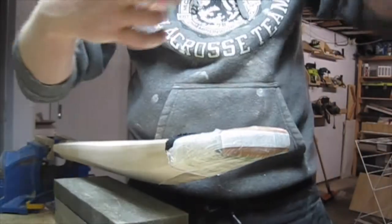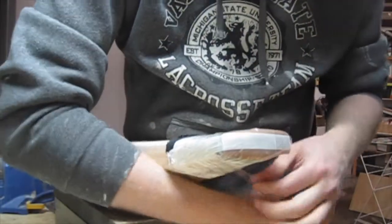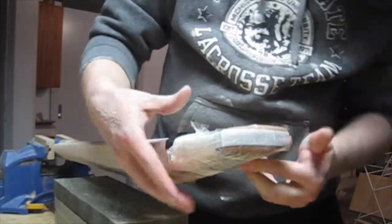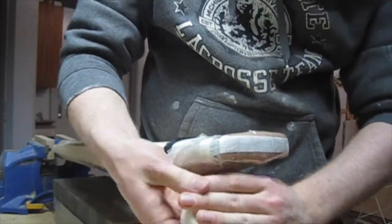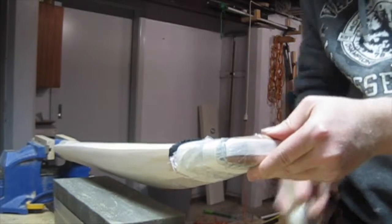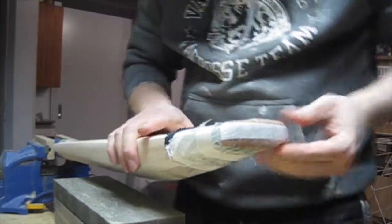Various points here through the stick up, you see me go round with just one round of tape. The reason for that is because we're putting the tape under some pressure. It can have a habit of loosening off, and what you don't want is your full tape up to loosen off as you're getting finished. So just a couple of pieces around at each interval.